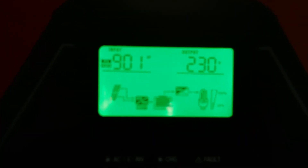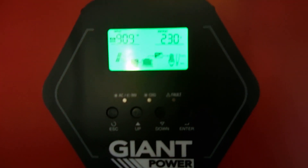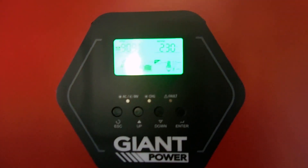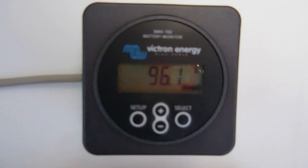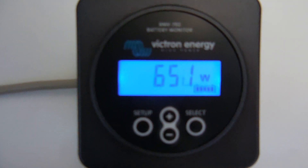The peak I've seen so far in winter has been around 1.5kW from the 5kW system, just because of the shadowing and because the sun is so much lower than in summer. Over here you can see the battery bank is currently at 96.1%, with 650 watts going into the batteries. The total is about 900 watts, with the remaining power going into the house to run the fridge and whatever else is on.